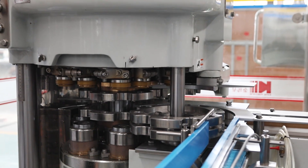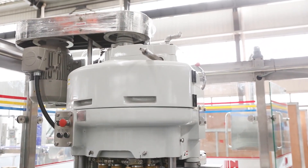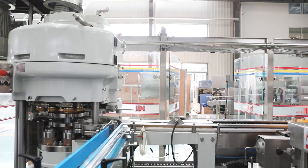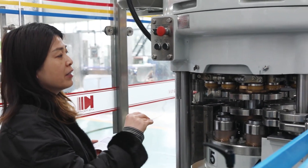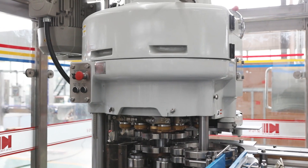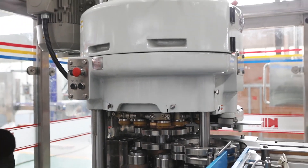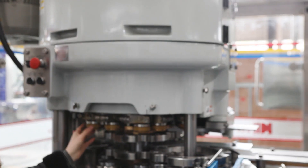The electrical driving system for the filling machine and the seaming machine uses a servo system. Power is supplied from the seaming machine and it controls the filling. Without cans, there will be no caps applied. The machine also has centralized water drainage. We cooperate with a Taiwan company for the seaming heads, because the shape is very important. The lifetime of the seaming heads is 10 million seaming operations.